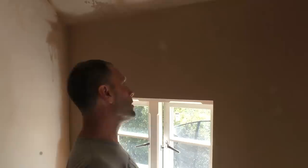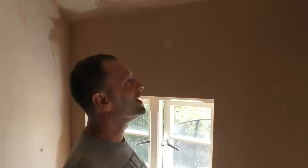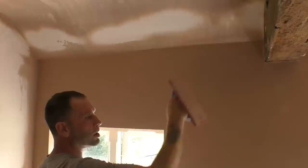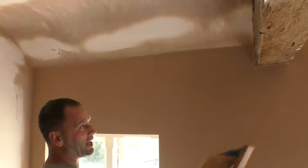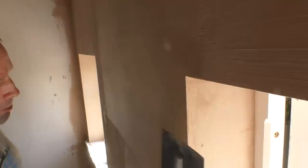What happens if you don't splash water on as you trowel? You won't get straight lines — you'll get little lumps of plaster that have gone off too early. If you're plastering the ceiling and starting on the wall, if the internal angles are dry they'll suck the plaster and you get lumpy bumpy angles, not a nice staged angle. So wherever it's dry, wet it down to stop the suction and slow it down. See that? Look how quick it goes off just by using the sponge — the air gets into it. So you're doing the cross-trowel already and it's starting to go off.